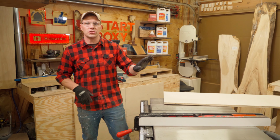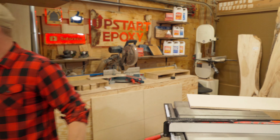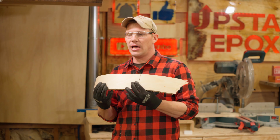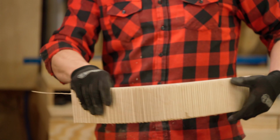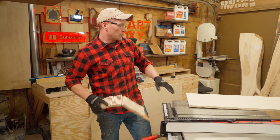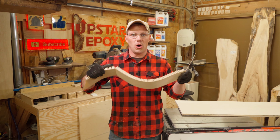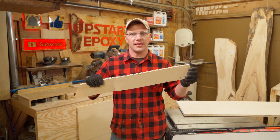We're going to get a whole bunch of strips on this, and then we're going to run them on the miter saw so that they're flexible. Check this out. So when we wrap the circle, after we cut the 2 circle ends of it, we're going to need to make sure the plywood is flexible so we can wrap it and get that nice smooth oval section. So we're going to rip this to 3.5, then we're going to cut the circles on the oval itself. We're going to cut these side walls so that they're flexible, and we are going to build that form.